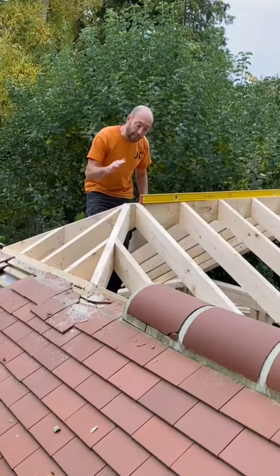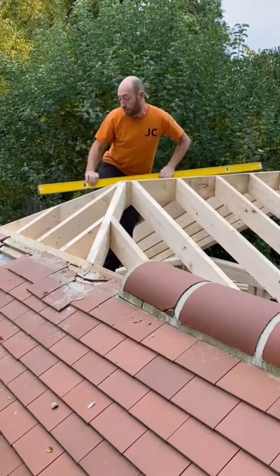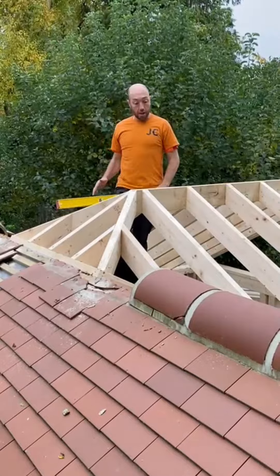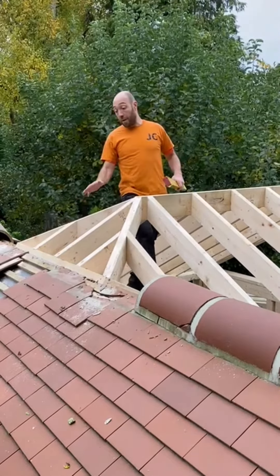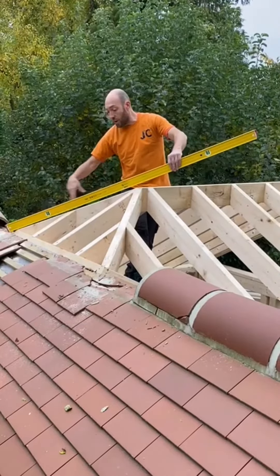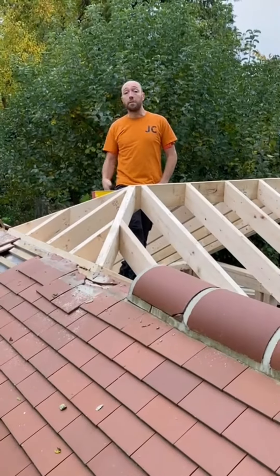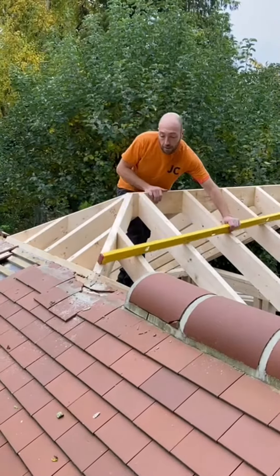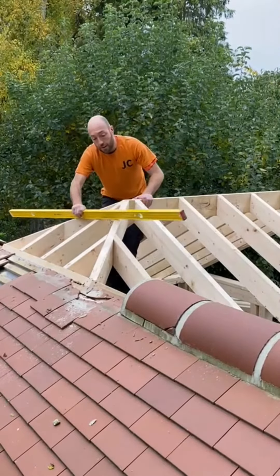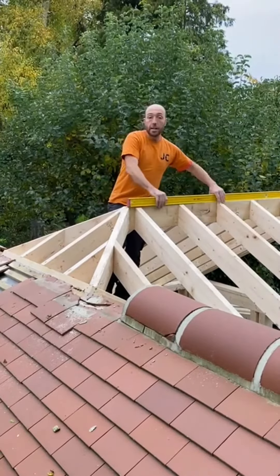When I put this in it just wants to work with my rafter at the back and my ridge, and when I put my straight edge in there that will work well. Hips are a little bit more difficult — I don't think there's exactly a rule of thumb for that, so I'll just hold it up tight, get the angle, and I'll scribe it. I cut one, scribe all the angles on it, measure it from my point and it'll work well. Good work tips — that's a barn hip.